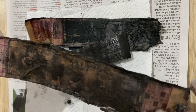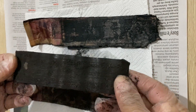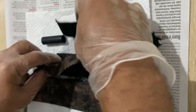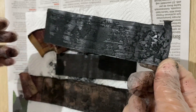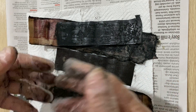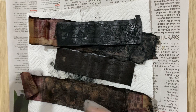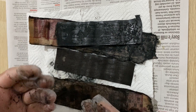This is the second separator. So if you use a lead plate with lead oxide on it for the positive electrode, and a lead plate with activated carbon on it as the negative electrode, it is very easy to make a hybrid supercapacitor. Roll up all of them, put it in a small bottle, and add a 30 percent sulfuric acid solution — you will get your own hybrid supercapacitor.